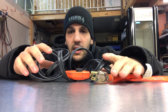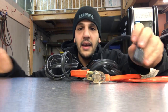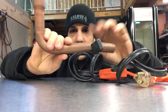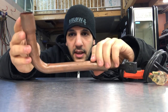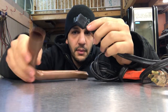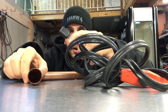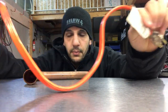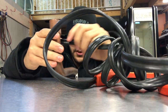So you got the purpose now, and you know where you should see this. Now I'm going to talk briefly about how to install it. I have a copper pipe here — for all intents and purposes, this is going to be my makeshift drain line and I'm going to show you guys how to install it. First thing you want to do: get the black end, the tip of it — not this end obviously, but this end. This is the heater part. The black part is the heater. The rest over here is all the electrical components. How you want to install it is start from the tip of the drain.